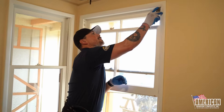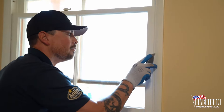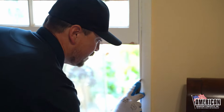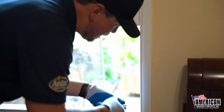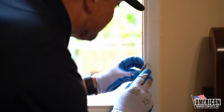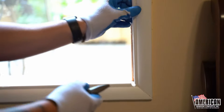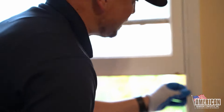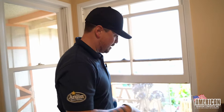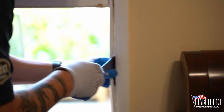We're going to start and cut — score a paint line right here along this trim. Once we do that, there are little tiny finish nails that are basically holding this to the main frame, so we're going to pull this off. We want to cut this carefully because we're going to reuse this interior trim. Now that we've done that, you can already see how it wants to pull off, so let's assist that.